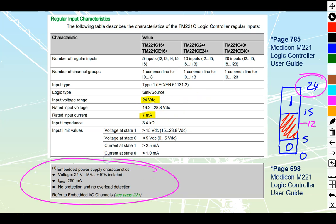The last thing on the data sheet is the embedded power supply. There is a built-in DC power supply in these units that puts out 24 volts, with a tolerance of minus 15% to plus 10%. It is isolated and has a maximum current of 250 milliamps. With my 16-input model drawing 7 milliamps each across 9 inputs, that's only 63 milliamps total — plenty of onboard power. Even the 40-class model with 20 inputs only pulls 140 milliamps, leaving plenty of margin for dry contacts and push buttons.